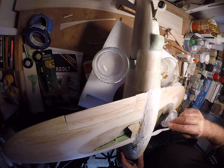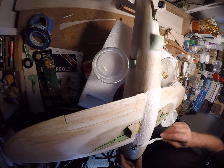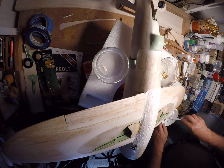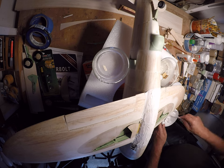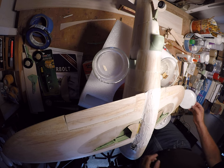This will take about four or five hours to dry, maybe longer on a day like this — we're supposed to get rain later. On dry, low-humidity days four or five hours it's ready to sand. More humid days six to eight hours.